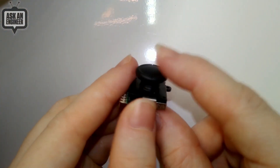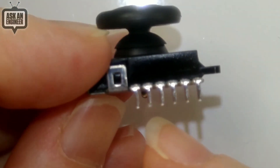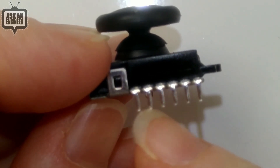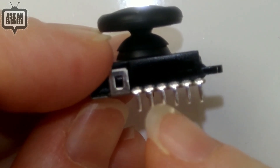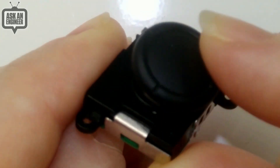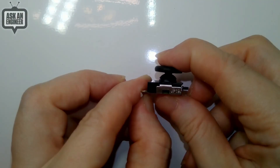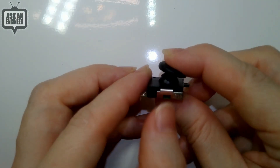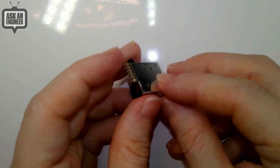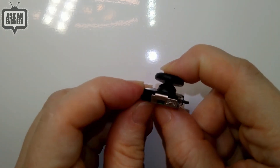It's got six pins — there are two analog joysticks and then one switch, so the switch is two pins and the analog joystick is power, ground, and then two analog pins. I just wanted to show what a nice analog joystick this is. It also has a select — you can't quite hear it but it does click in, so it's very Joy-Con-esque. It shows up as two analog potentiometers and a tactile switch.